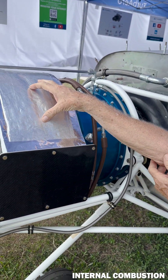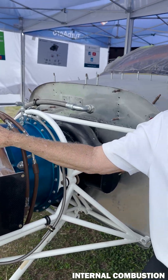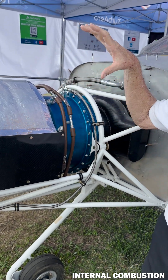This compressor brings the temperature of the inlet air from ambient to 200 degrees Celsius. Once we go through the recuperator, we get another 200 degrees Celsius. So instead of going from ambient to the 900-degree target and having to do all of that with fuel, this compressor and this recuperator — and we have not even introduced fuel yet — get us from ambient to 400 degrees.